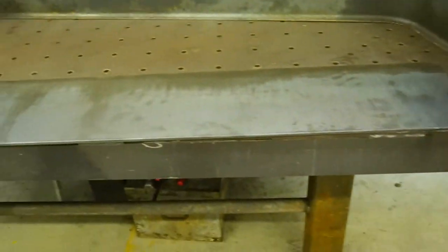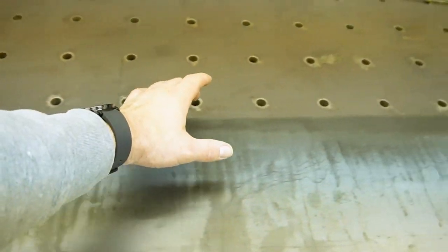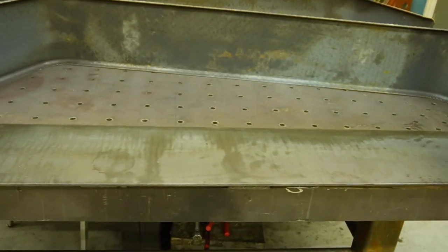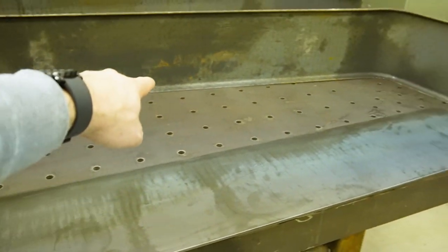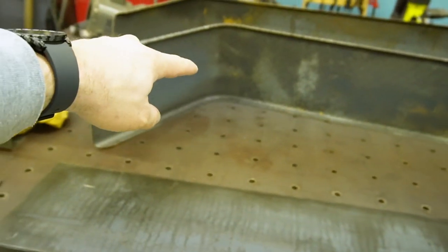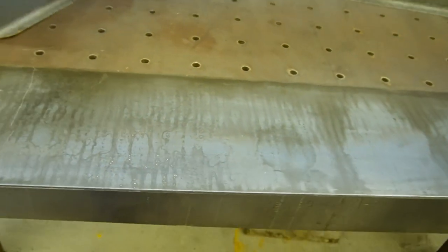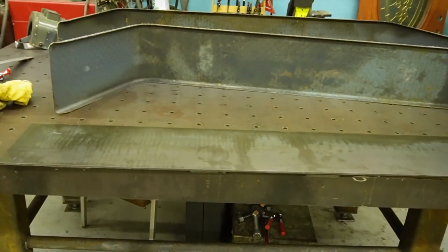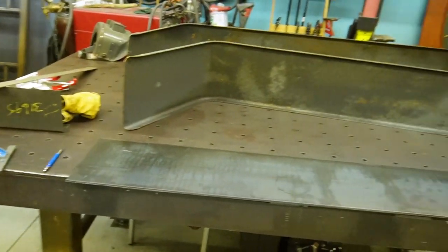For reasons, I don't have my tripod here. This will be the top. I'm going to draw a line quarter inch down across the entire top. That way I can bring this fender in, set it on that top, line it up to that line. I know I've got a quarter inch overlap, and then I can trace out that curvature for both sides. So I get this line drawn here, quarter inch across the top, match that up, center the fender on this piece. After that I can get everything traced down, get it cut out with the grinder at the skinny wheel.